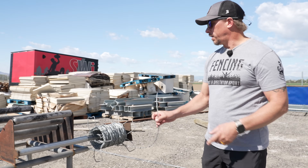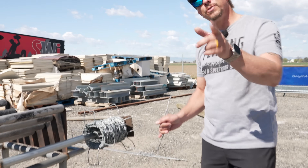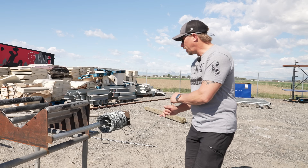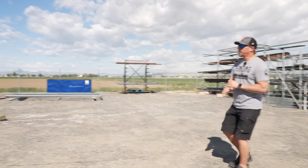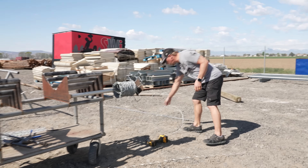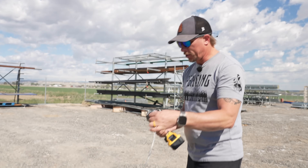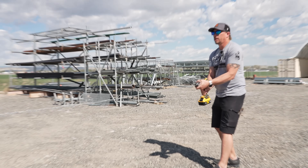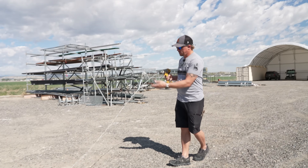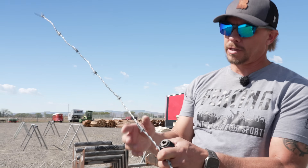This is low-carbon four-point barbed wire, which is used on just about every chain link fence you've ever seen. If you're going to use high-tensile, this trick probably won't work. When barbed wire comes off the coil it wants to spring back into a big wadded-up coil, but there's a way to make it a lot easier to work with and stretch so we don't have saggy wire on short runs. All we do is add some more twist to it — that makes it nice and straight, does not weaken it, but makes it a lot easier to stretch out.